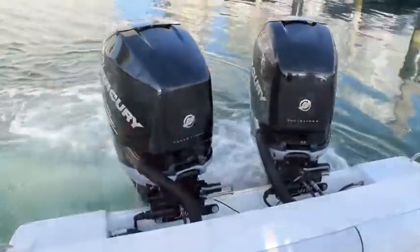There's what's called a personality, and that makes this joystick work perfectly for this vessel. The joystick only works on twins, triples, and quads — we even do single and dual helm as well — and it has to be DTS, so our Verado engines are all capable with the joystick. Even our Mercruiser DTS engines are capable.